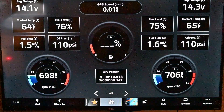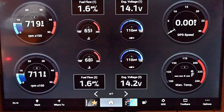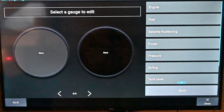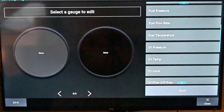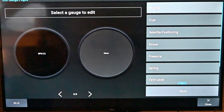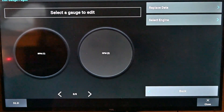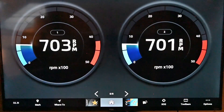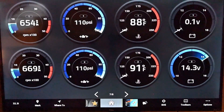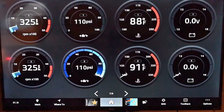Here are some additional templates available on my Garmin 8612. Some of the gauges are populated with data sets already, and some are not yet. In order to show you how easy the programming is, I thought a quick easy page would illustrate this best. First select options on the lower right menu bar, select add page, select the page you want, then select each gauge and select the appropriate info you desire. In this case, I'm adding two RPM gauges. Select close and it will show the desired results. As I turn off the engines, you can hear the engine stop and observe the slight delay in response on the electronic but analog visually displayed gauges.